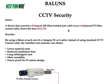Long cable and signal runs are another benefit. In a UTP system using baluns, we can get distances up to around 2200 feet passive-to-passive, balun-to-balun systems. That's right around an RG11 style. There is some compromise in system quality or signal quality in a UTP system, but the cable runs can be long.